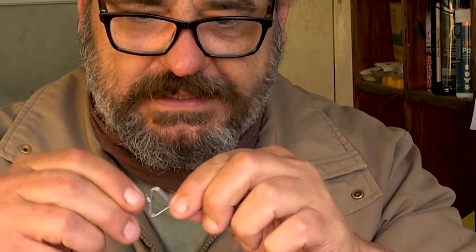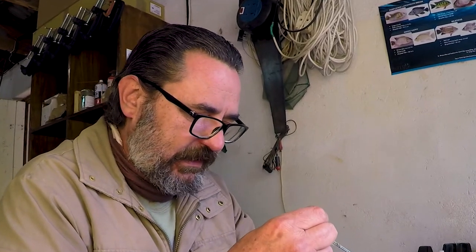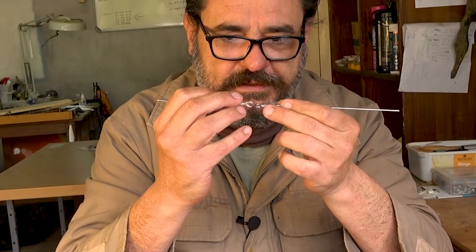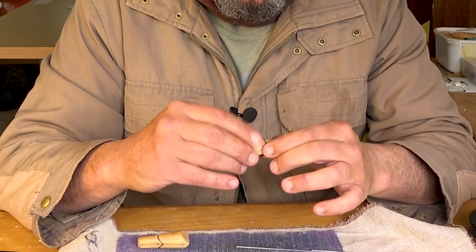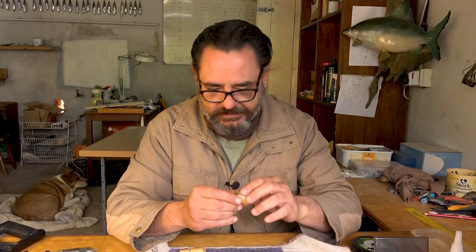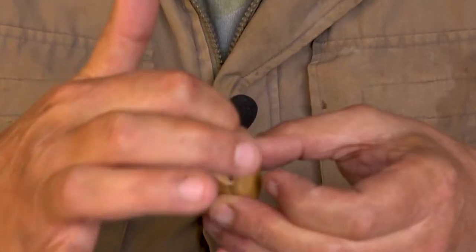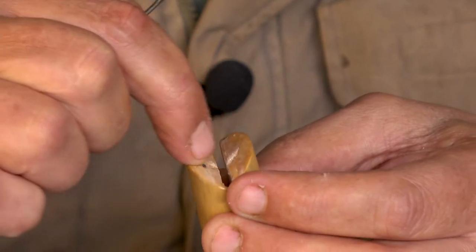You might be asking why I've got these big long straights here. Kunz had mentioned that he had built a sand eel and had some difficulty. The method he was going to use — two rings joined together — has the problem of how do you avoid the play? How do you avoid each piece turning against each other? One thing is the recess and the V of the wood would help to a degree, but you need something else. So what I've done with each piece of wood is I've made a recess in the tail end of the V where the round circle will go and give its play.